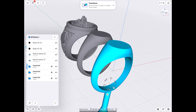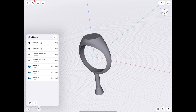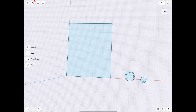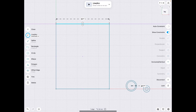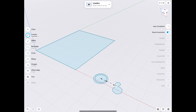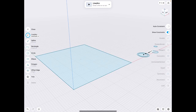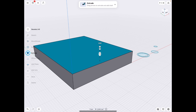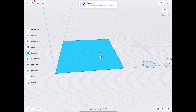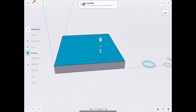Let's get rid of those and start the design process. I've designed this mold with a little bit of industry standard in mind — it's not exactly true to industry standard, because frankly these molds are all different sizes anyway. It really depends on what the design you're molding requires. I've made this one 50 millimeters wide by 60 millimeters long, and the depth is yet to be determined because we don't really know how deep it needs to be. So let's start with that 50 by 60, and let's make this 6 millimeters — or quarter inch.